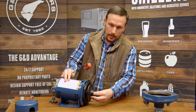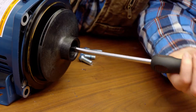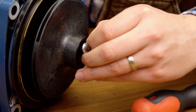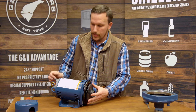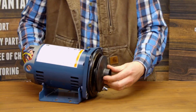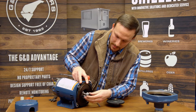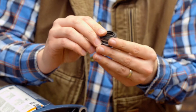You'll need a screwdriver to take that screw out. Sometimes you'll need to get a hold of the shaft on the back side and take off the back cover. On these smaller pumps, that's just a quarter-inch nut driver on the back. Now we need to remove the screw that holds the impeller in place. Note: this is a left-handed thread, so instead of righty-tighty lefty-loosey, it's the opposite.